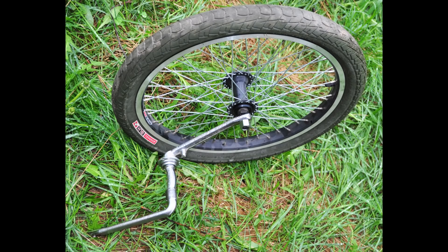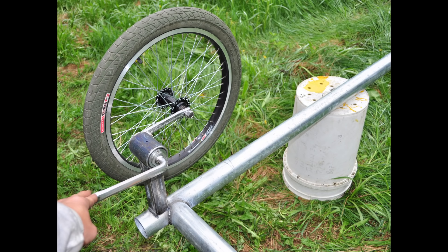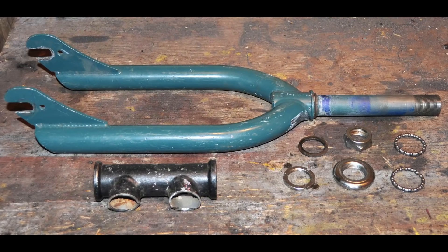The wheels and landing gear are all made from scrap bicycle parts I had laying around. These are 20-inch BMX wheels — nice and strong. The lever system that moves the rear wheels up and down is made from bicycle cranks cut from old bikes found at the scrap yard, though you can also get these parts new from any bike store. The rear wheels are bolted to one side of the cranks and the other side acts as a lever — when you push down, the wheel comes up and lifts the frame. For the front steering system, once again just parts chopped out of an old bike.